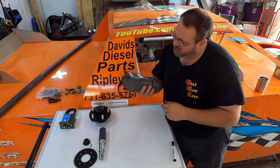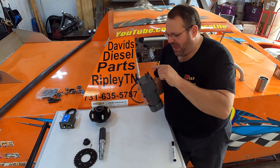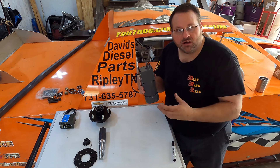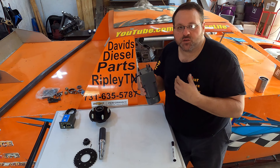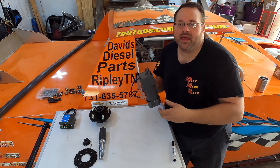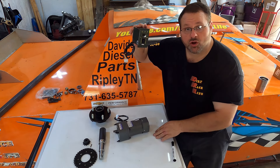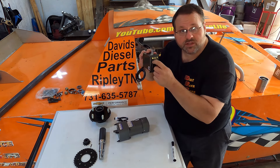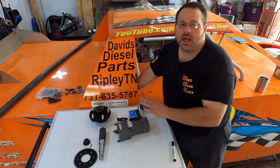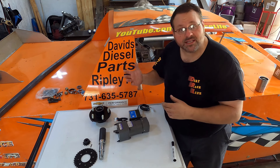Let's talk about parts for a second. This right here is just a cheap brushless gear-drive 120-volt AC motor — half-inch drive with a keyway coming out at the end. In the past I've built these tire grinders with like a 12-volt window motor and it works good for buffing or grinding, but it doesn't have the torque you really need when you're trying to do some grooving or siping. So this is a step up for me. It's a brushless motor so it has to have a controller — this unit comes with a controller with speed control, on/off, and the ability to reverse direction. Around $100–$125.